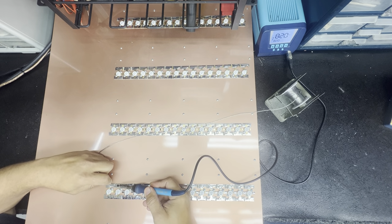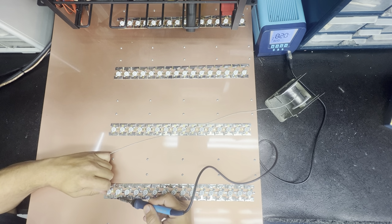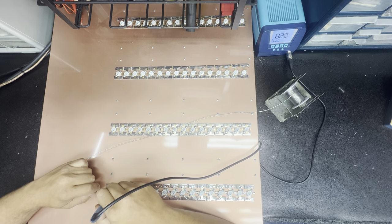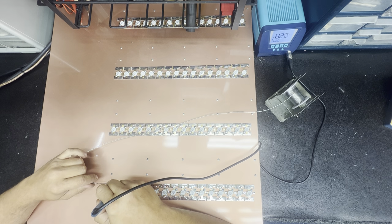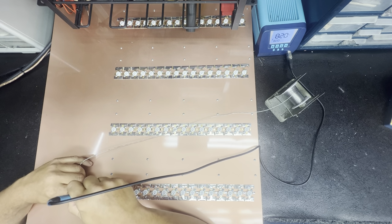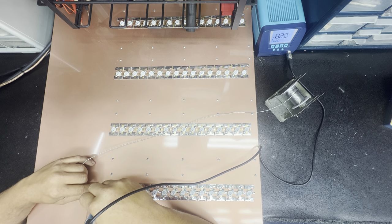When you're setting the volts on the power supply, if you went through all your power supply modules and put the variable in the same place, you're going to end up with different voltages on any of them. So that's what's going to happen with controlling them all. The power supplies are not built exactly the same. So you use one controller at X amount of ohms or whatever, and you hook it to five power supplies, well, you're getting five different voltages, which I've got one like that, but it ain't good for stuff. Come up breaking some power supplies.